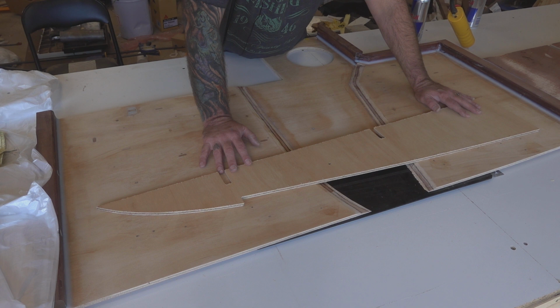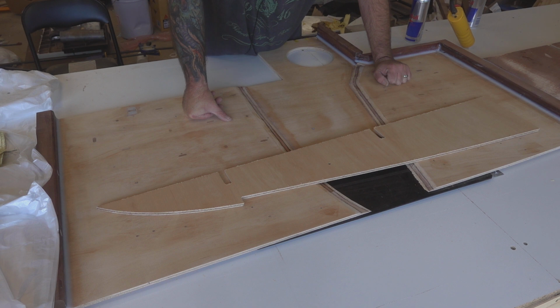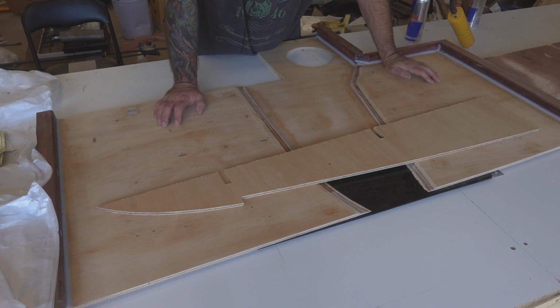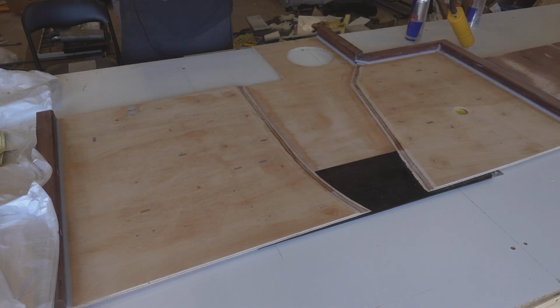So really what this boils down to is the fact that I have a 30 millimeter by 1500 millimeter hole in the bottom of my boat, which can't be got around. So I need to make sure this thing is watertight. Also, because it's only 30 millimeters thick, I need to make sure that it doesn't deteriorate quickly or basically fail in the long term. So to do that, I am going to line it with some reinforcement.